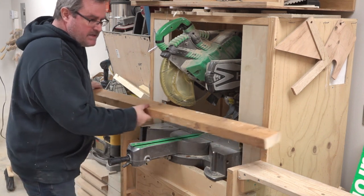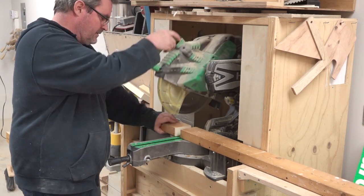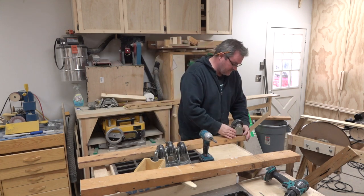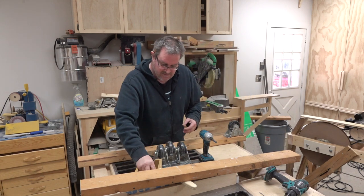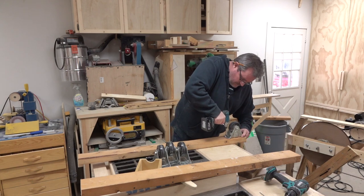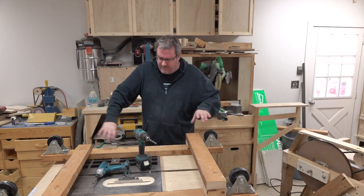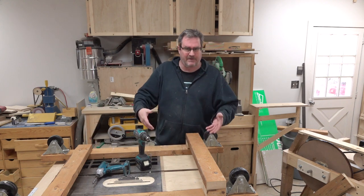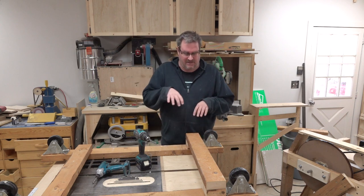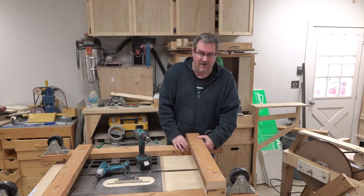I want them to be 48 inches long — that's how long the cart is going to be. There's not a whole lot to this cart; it's very easy to make. I've got these two longer pieces, and the casters just get screwed in place on the end using one-and-a-quarter inch screws through holes I already drilled. The way this cart is put together is that the long pieces go through, the casters are attached to those, and the part that actually holds up the logs is underslung — underneath the cart so they stick down. That puts a lot of pressure on the joints where they join the long pieces, so they have to be strong. I'm going to use three-eighths threaded rod to put those together.